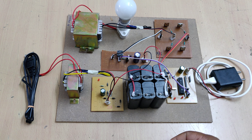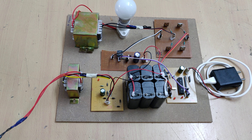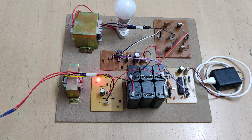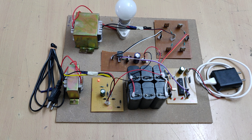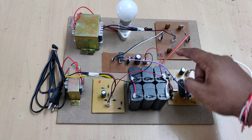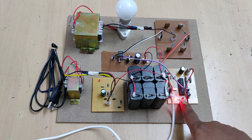To charge a battery, connect 230 volts AC input to this power socket and we can charge the battery in a duration of 8 to 12 hours maximum. Once the battery is fully charged, you can switch it off. Now for the demonstration using only the battery: when we switch this on, the system provides 12 volts DC input to the circuits, which is the input to the H-bridge circuits. We then switch on the microcontroller and the LED will blink on and off two times.